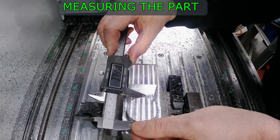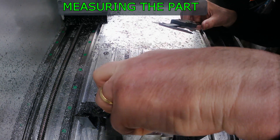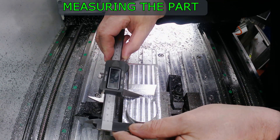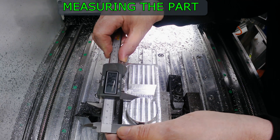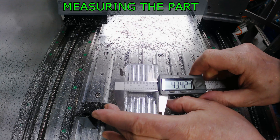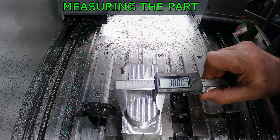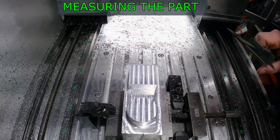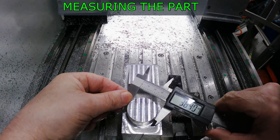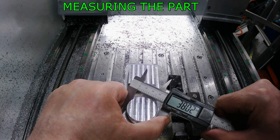The circular cuts come out slightly undersized, and it looks like the roughing pass has taken too much off — I should have left more stock. There's a chattery finish on the inside edge. Still slightly under, still 0.6mm undersized in X. We're pretty much spot on in Y. Across the angle, that's really good for machining a circle on a homemade machine.